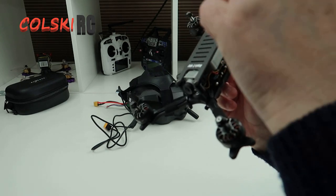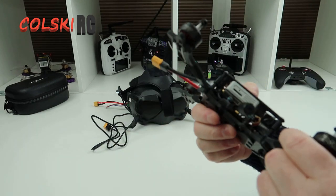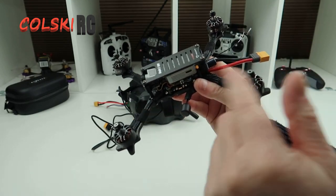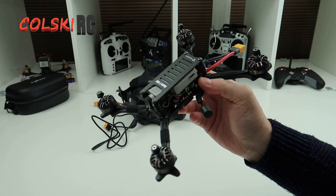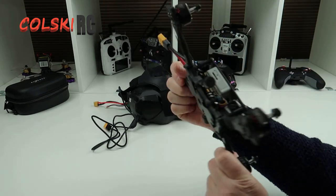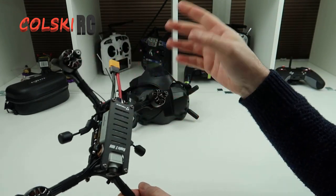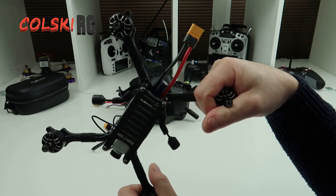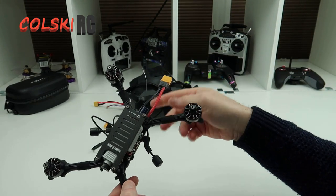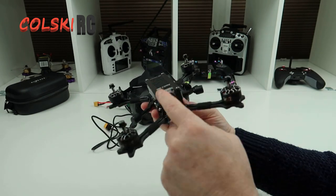So as you can see I've got the stack built in. I had to put the top on to make sure all the wires fit in - it's difficult to get in and once I put it in place I wasn't taking it back off again. All I've done is connected two wires to RX6 and TX6 from the TX and RX on this unit, swapping them around. You need to go and liven that UART up on Betaflight, which I haven't done yet. The only thing I've done is tested the camera - at this stage I always test the camera to make sure it works. It's going to tell you it's not activated, but just make sure you get a picture. Also this air unit is now out of date even though I've just got it - it's one version back and it needs to be set up.